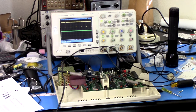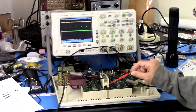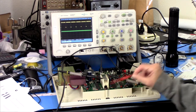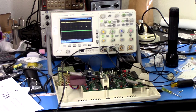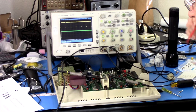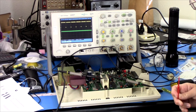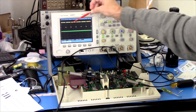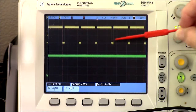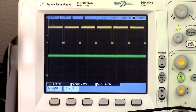Yaha! I have found a clue. We're looking here at the IIA chip. It's the MC6822, only it's got some weird XC part number. As it boots up, it boots to the green screen, right? And then there's a periodic pulse here at a 60th of a second, which is supposed to generate an interrupt.